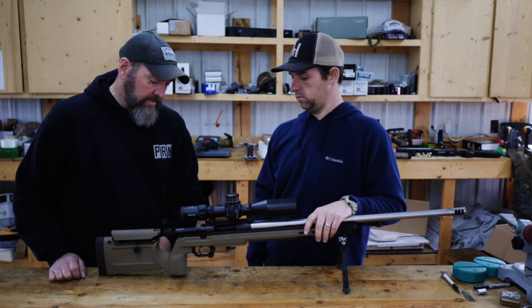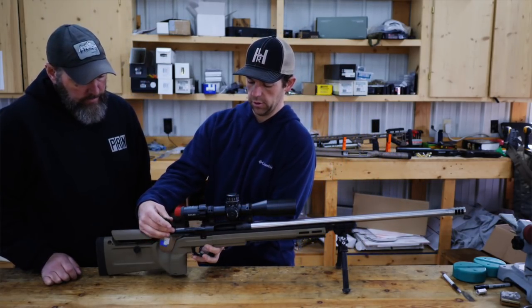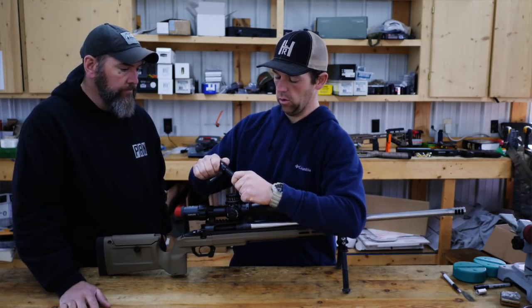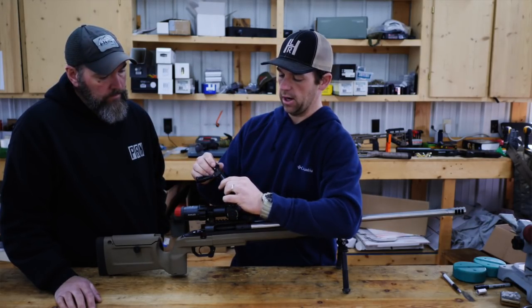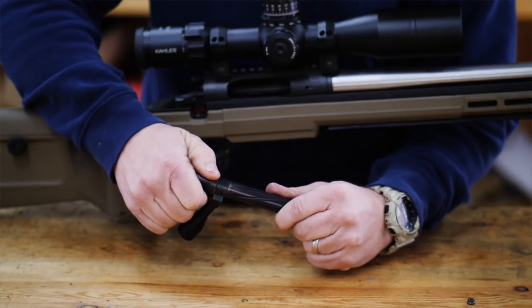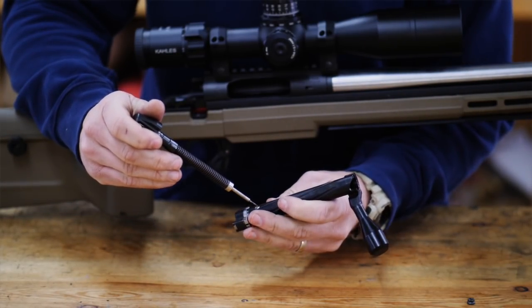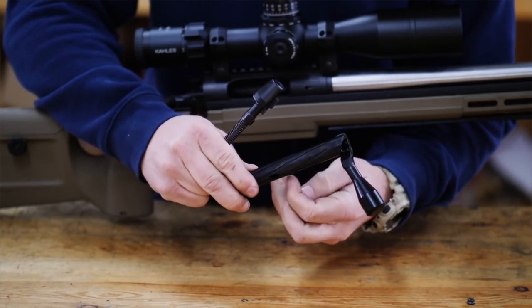This has a cool feature in that it's field strippable. It's got a bayonet-style lug on the firing pin. You turn that backwards and you just pop it — it pops straight out. No tools to do any of that, no tools to put it back together. If you want to clean it or brush it out, whatever you want to do. And you pop this little pin out, and there's your bolt head.